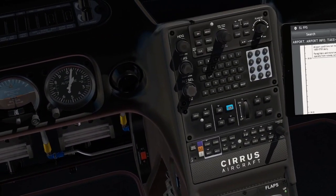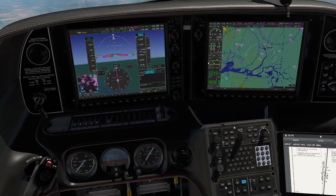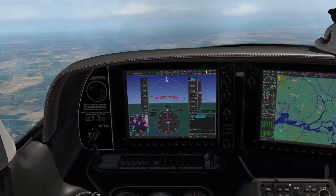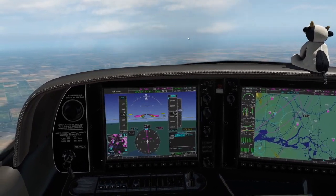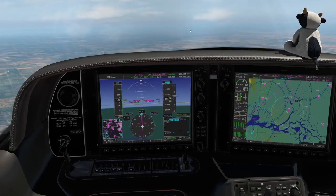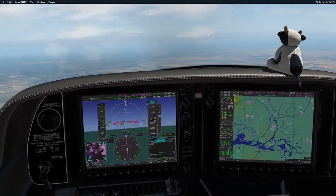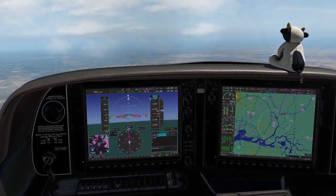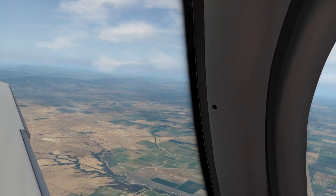We have Cirrus's famous level button — the blue button. If you're disoriented or nothing else is working, or the autopilot does something funky, you can pound the blue button and the airplane will level itself. It levels itself using pitch and roll only, with the AHARs setting about a three-degree pitch and leveling the wings — it doesn't use any other information. So if you have a pitot tube failure or GPS failure, it will still level the aircraft. It won't maintain altitude because it's maintaining a pitch, but it's a good 'oh crap' button that stabilizes the aircraft so you can figure out what's wrong.